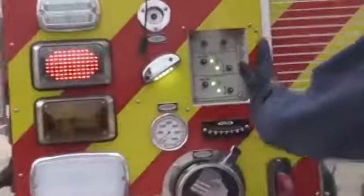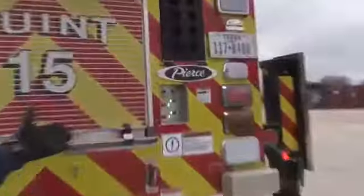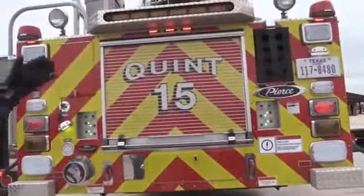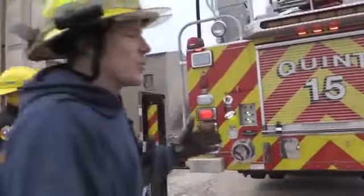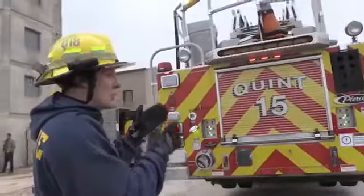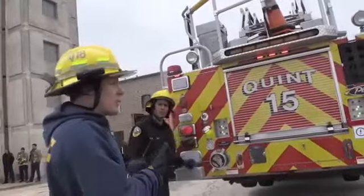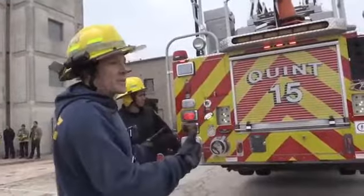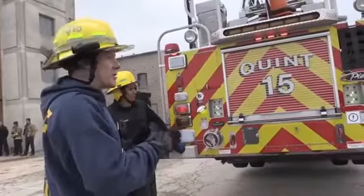He's got 4 green lights, and he goes right up to the turntable and starts making sure. You have to double check and make sure you have the 4 green lights. Then he's up to the turntable and he's picking people off. You notice the one thing we didn't do at the very end, we didn't pin the stabilizers. When we're doing a high situation rescue, we've got somebody to pull right now. We don't have to pin the stabilizers. We're gonna get up there, we're gonna get them down. Once they're down and we're going to a defensive fire or doing anything else, we will pin the stabilizers once we have time. But for the initial rescue, we're able to not pin those stabilizers, we just go up, okay?